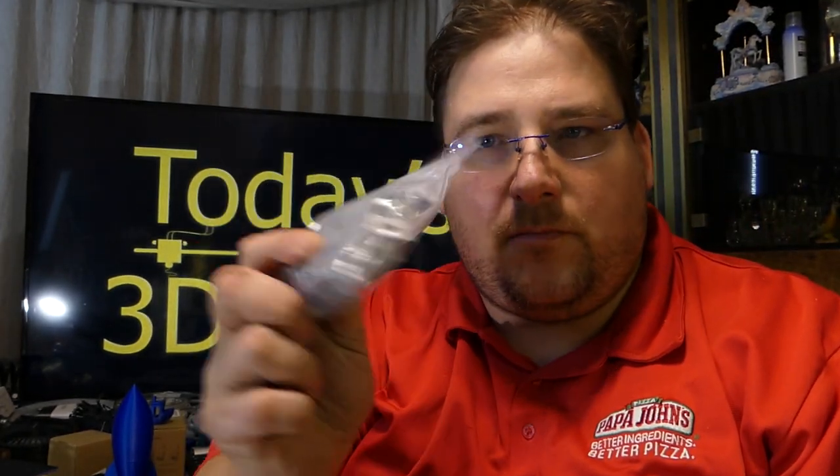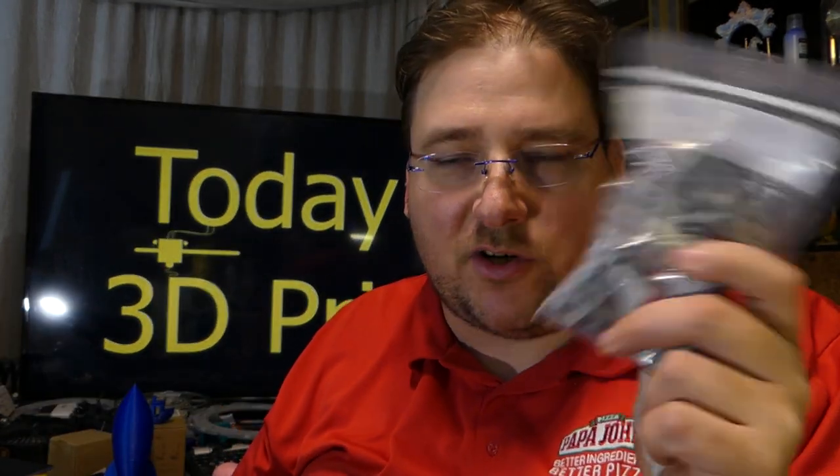I have the reinforcements installed — the brackets to reinforce and connect the two aluminum extrusions. Because the engineers at Zonestar said, 'hey, everybody's using V-rail extrusions, let's use V-rail extrusions' — and then made the acrylic a structural component. Why bother going with beautiful, strong aluminum V-rail if it's all connected to acrylic and not to each other, so it all wiggles around? That was really dumb. It's a cheap and easy fix — you just need some M4/M5 8mm bolts, some corner brackets, and hammer nuts. Problem solved.